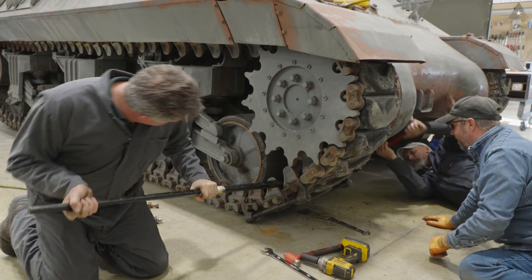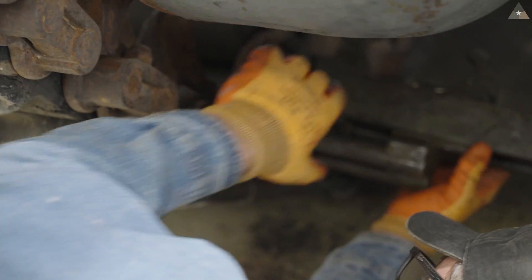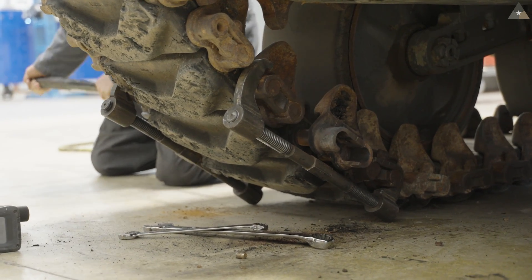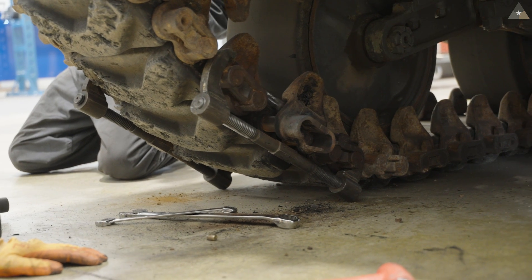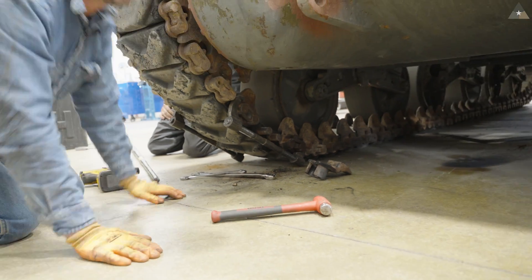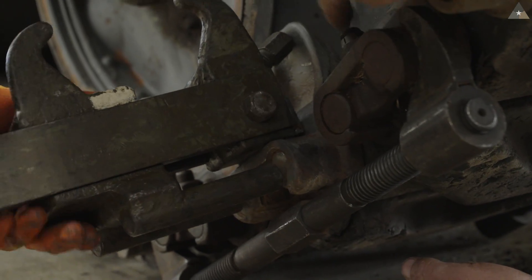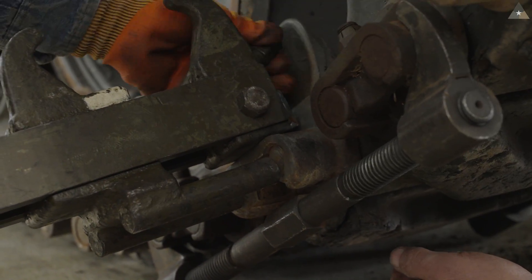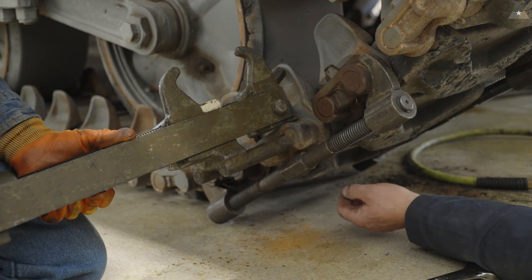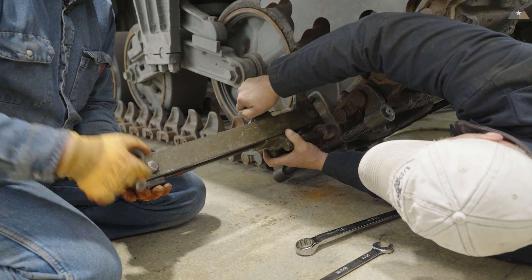She's winking — coming off. What we're trying to do is put that pin right there down inside that hole where that bolt came through. Now he's going to tighten it up so that holds this thing from coming up so we can adjust it so it always stays parallel with the track link. We may need to put some heat to that again.